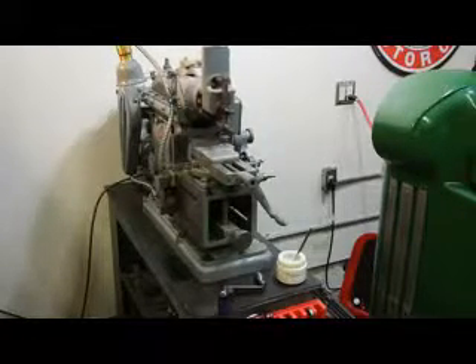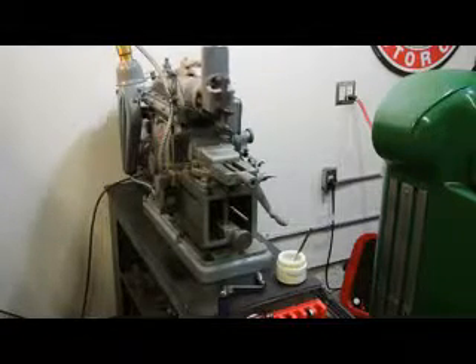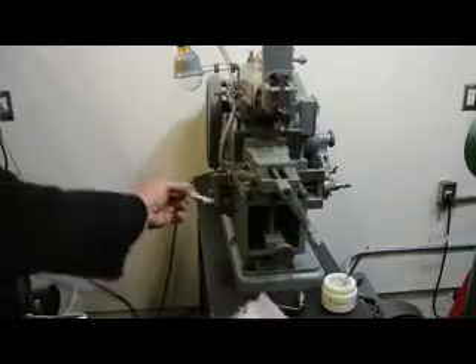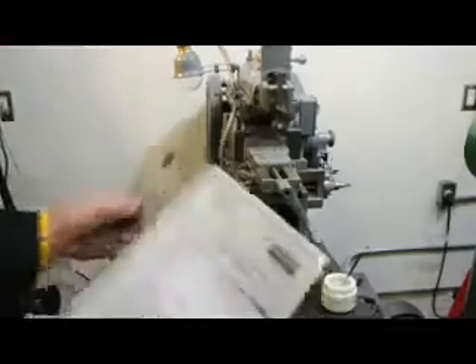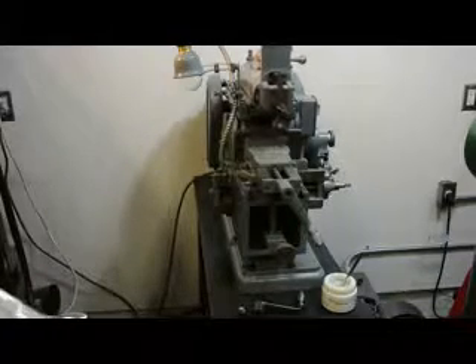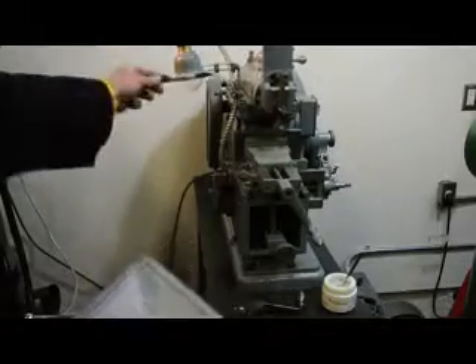Now, this actual machine comes very well tooled. It has a vise with it. It has an indexing table — I call it a rotary table but it's a five and a half inch diameter indexing table. You'll note the T-slots on the table; the table area is T-slotted on the sides and the top. It happens to be a very generous sized table: six and a quarter by five and three-eighths by five and three-eighths. It's a half horsepower main drive motor. This machine is running 110-volt, single-phase.